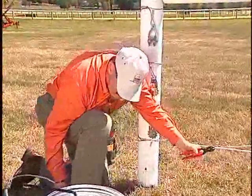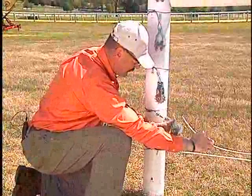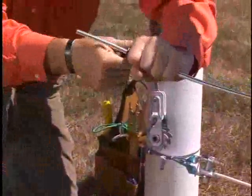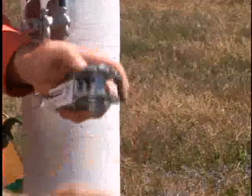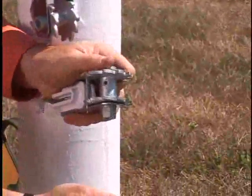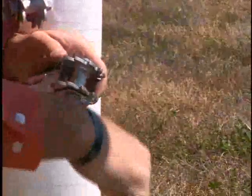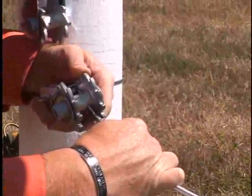Stick it back inside your spinning jenny. Now what we've got to do is remove a little bit of that polymer to be able to get it into the drum itself — about four inches or so. Bring it up. You'll notice that one side of the hole is a little bit larger than the opposite: this being the larger side, this being a little bit smaller. Kind of works like a funnel type situation — use it to your advantage. Run it around towards the bottom itself, taking as much slack up as you can. Run the wire up into it until it's just sticking through just a little bit.